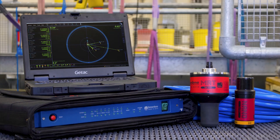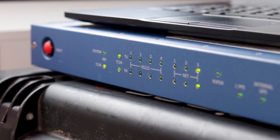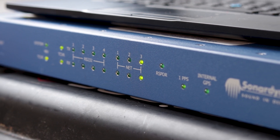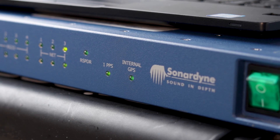You'll need your own PC or laptop to run Ranger 2 underwater positioning software. The ESH is the network interface between the subsea acoustic equipment, the GNSS satellite equipment, and the PC that's running the Ranger 2 software. It also provides power and comms to the MRT transceiver. It's important to remember that this needs to be kept dry, so consider where you're going to install it.